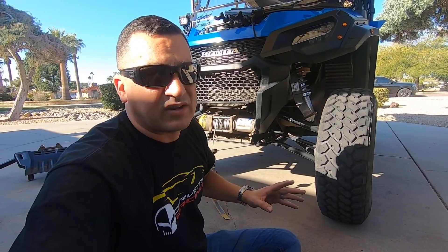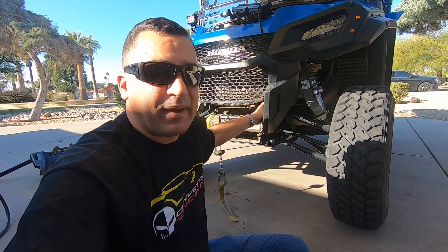So the next thing I'm going to do is put my jack under my frame brace, lift it up — I'm not going to take the tires off the ground. I'm going to take these top A-arm bolts out. I'm going to take these old welding coupons that I never used, drill some holes in my little drill press, and tack up basically an L bracket. I hate welding on my machine so I'm just going to do a couple of tacks and I will have the ground actually touching the metal. I did get my calipers out — I think they're like eight bucks on Amazon. I could have bought some pre-made gussets for like four bucks a piece but I'm not going to do it. I'll just use the scrap piece of this coupon.